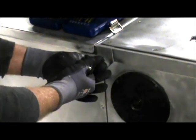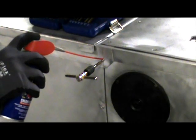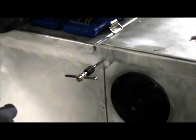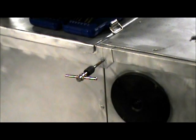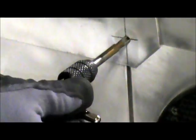Just turn and keep constant pressure on it. Once it starts, apply just a little bit of lubricant on it. This being aluminum is a fairly forgiving material. If you were drilling into hardened steel to tap threads, you'd have to use more lubricant and keep lubricant on it. You can actually watch this — it isn't hard to turn, but as you turn in you will feel increasing pressure. If that pressure builds, you need to back the tap up to clean out the cuttings. This may take several attempts. Aluminum, as you can see, makes it pretty easy. That's done.